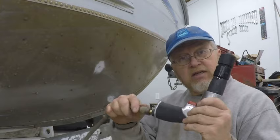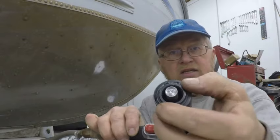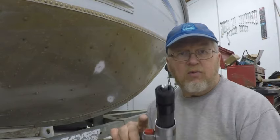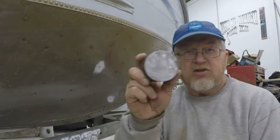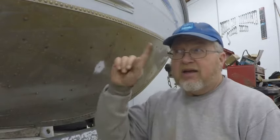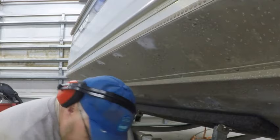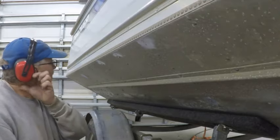This is a variable speed impact hammer - you can buy these at Harbor Freight for about 50 bucks. The only thing that's special is this chisel that goes in it; you have to order those to fit the actual rivets. You can use about any maker as long as you get the right size for the right type of head. You also just need something to put on the inside - you can use a sledge hammer or anything smooth. I've got my son-in-law coming over. He's going to get on the inside and hold the bucking bar while I use the hammer on the outside. We've got three half-inch rivets to put in.